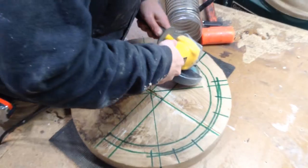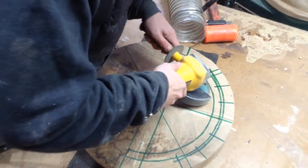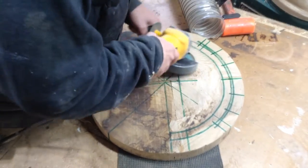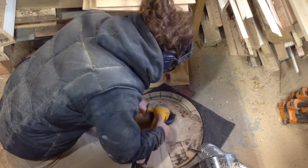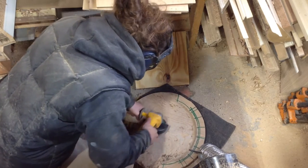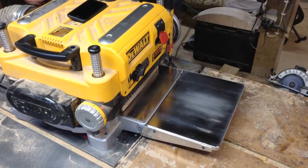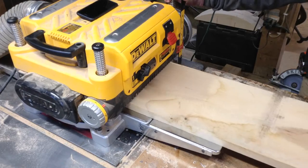Once I had all those marks I could start carving into the seat. The seat wasn't going to be intensely carved, but I wanted it to fit the bottom a little nicer than just a flat chair. Most wooden chairs have some sort of detail carving — usually a recess in the back for your seat, and material removed where your thighs meet the chair, otherwise it feels like the chair is digging into your thighs. It's hard to see the depth and detail in the video, but I just have a medium-grit abrasive disc in the angle grinder — it removes material really quickly.